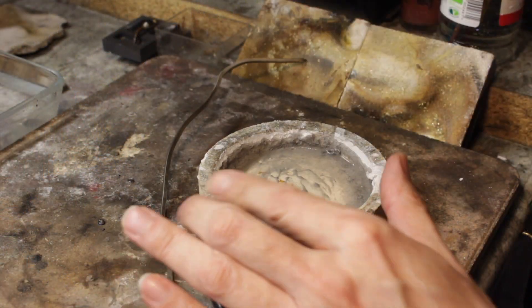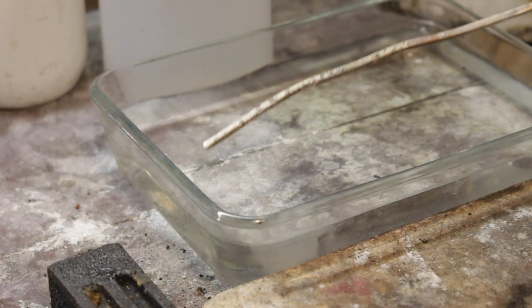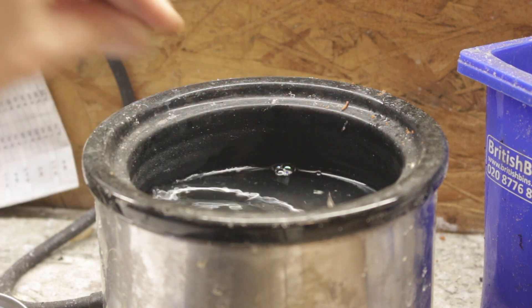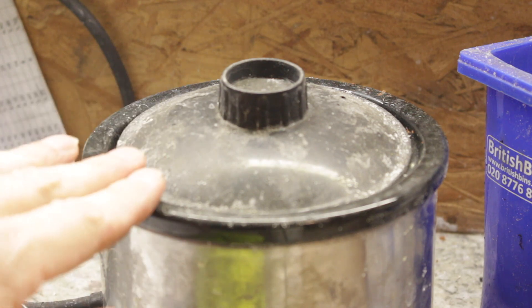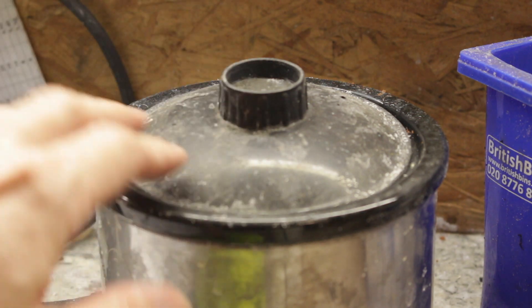What if you don't have a dark area to control the light? Here are a few tricks for working under daylight conditions. If you have borax, paint the flux along the piece and then heat it — as soon as the borax turns glassy, remove the heat immediately. Again allow it to air cool for a few seconds to black heat, then quench in water as before. Pickle it afterwards if you want to remove the flux, but only after quenching. As a safety tip: don't put hot metal directly into acid, as it can splash and creates hot fumes.